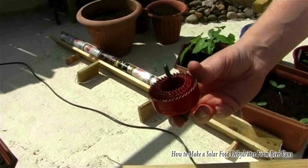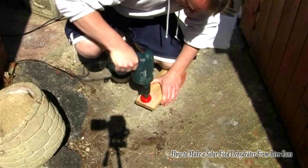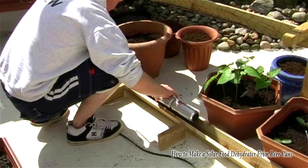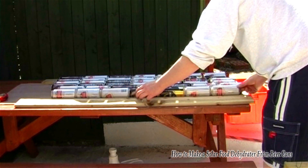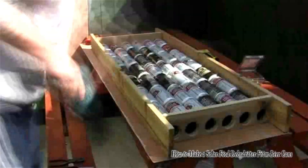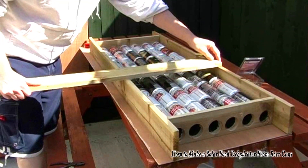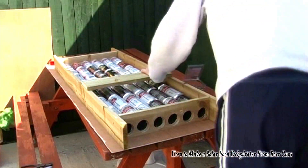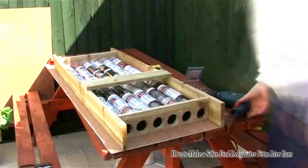While the tins are drying I used a core drill to cut out the necessary holes in the end caps for the main assembly. Once the cans are nicely dried I just need to lay them in position and then roughly set up the box arrangement around them. Once I'm happy with the arrangement I need to apply a couple of temporary braces to hold the box in position while I apply the back. These are just temporary struts only there to hold the box in position — I'll be removing them as soon as the back has been attached.